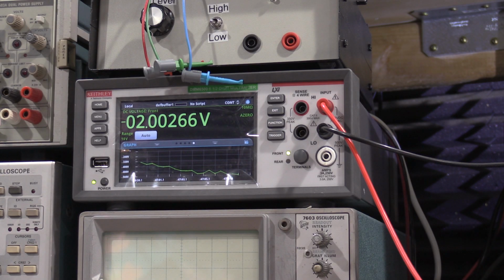Okay, step 2 is adjusting the calibrator voltage. This is positive DMM on test point 510. Negative DMM, which it doesn't say in the manual, is on ground. I just have it hooked to M on the power supply board, which is where it was hooked before. On the reference, you're looking for a reference voltage of 2 volts, plus or minus 0.5%. So we're at 2.00, well within spec. Everything's good here. Don't need to change anything.